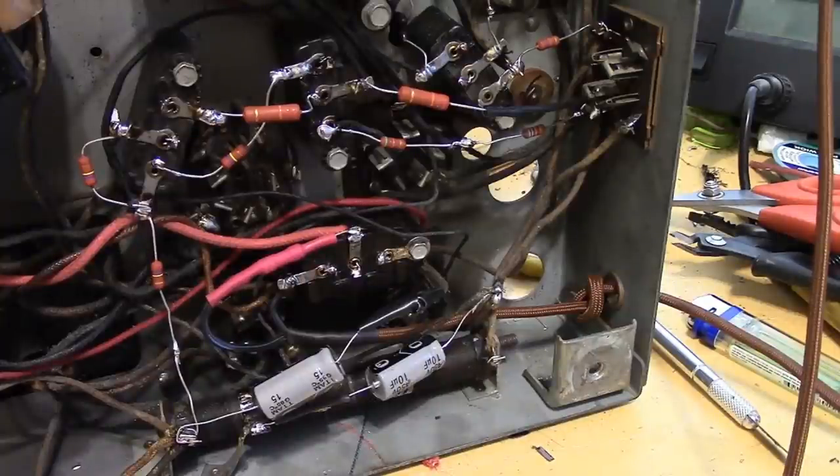So if they're absorbing a lot of AC ripple and they have some internal resistance, they will start getting warm. Again, this isn't a very demanding application. I'm just talking theoretically. Well, you can get caps that are rated for both higher ripple current and higher temperature, both of which translate to extended life. Some of them are even called extended life, high temperature, high ripple caps. They'll cost a lot more than these. Maybe instead of a dollar, they'll be $5.